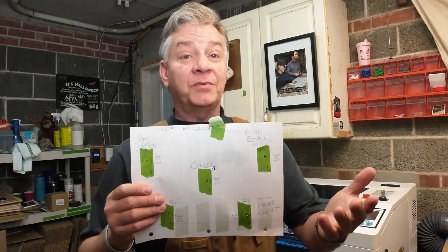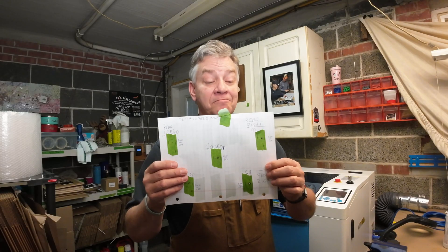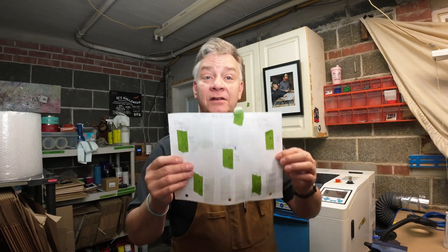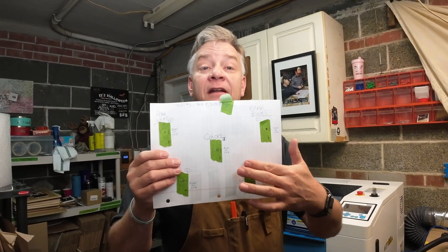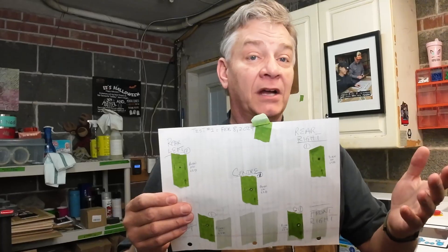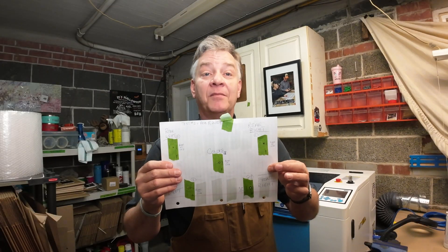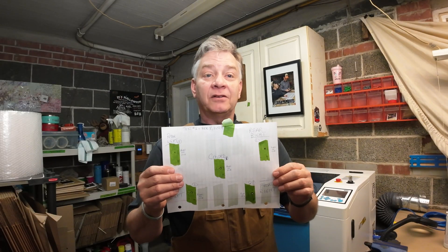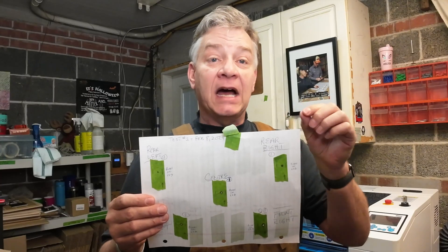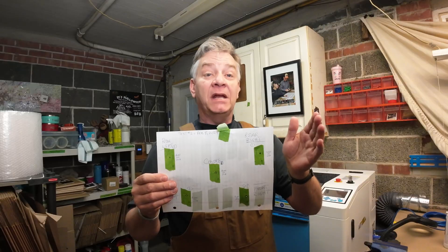After some great support from Thunder Laser Canada and from Thunder Laser themselves, they suggested I run an alignment test and I did. It's super simple, just takes a little bit of time. After I did, my alignment seemed reasonably okay to me. They took a look at my results and identified that two of my test positions were too much out of alignment. I took a few minutes, did my alignment, re-ran my cuts, and everything was back to normal again. I did not realize the importance of having an exact alignment, but that tiny fraction of a millimeter made all the difference.